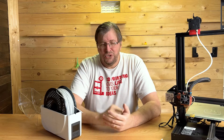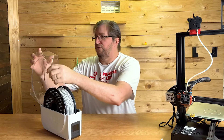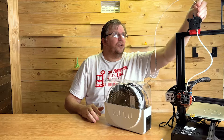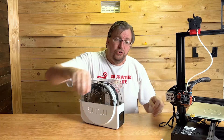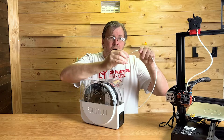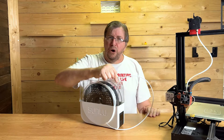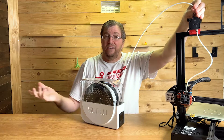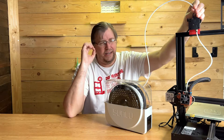At the beginning of this video I said I had two tips — so here's tip number one. What you can do is feed your filament out through the top hole and bring it over to your printer and run it into your extruder. But pulling it tight will put your filament under strain. So all you do is take a Bowden tube — these are really cheap — and pop your filament into the Bowden tube. It will also keep your filament from getting wet while it sits inside the container. You push it into the hole, which is perfectly sized for the filament, run it through to your hot end at the top, and it flows beautifully without putting any strain on your filament.